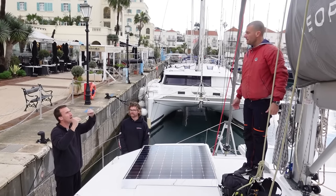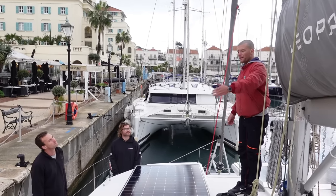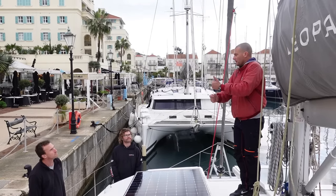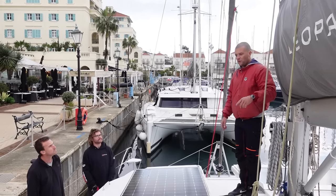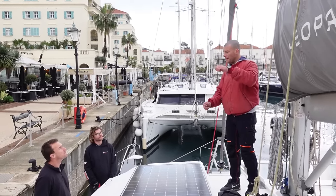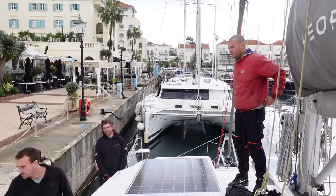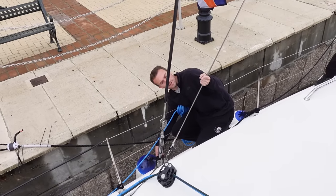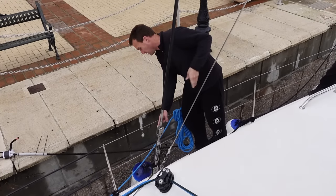At what point do you start doing one, two? The best is to do a U-turn with your hand. The first side, when you cannot turn with your hand, you stop, you go to the other side. You do the same. After you take the tape meter, you equilibrate starboard and port. What did you measure between, the chain? Was it the pin? Yes, you have to keep the same reference for both sides. So you just go from pin to pin. Pin to pin, what? Pin to pin. So at the beginning pin, you have to go to this pin.